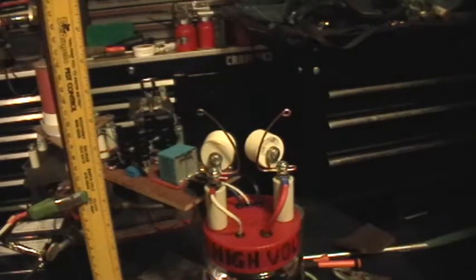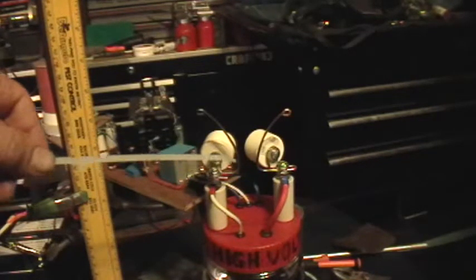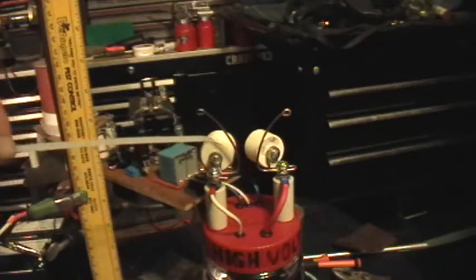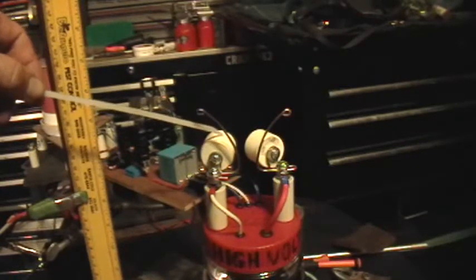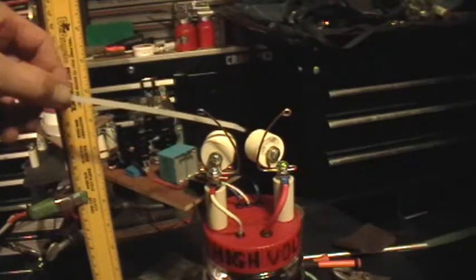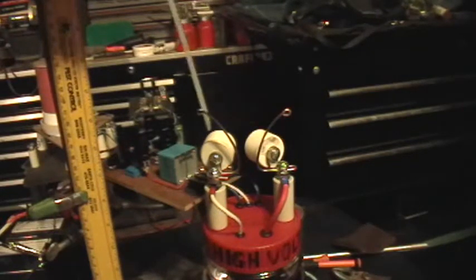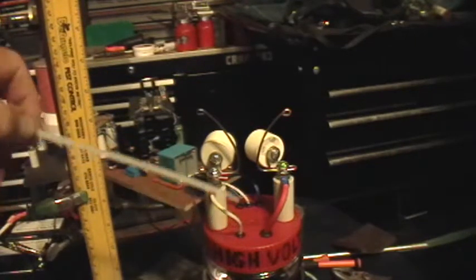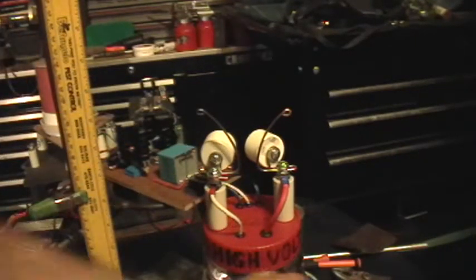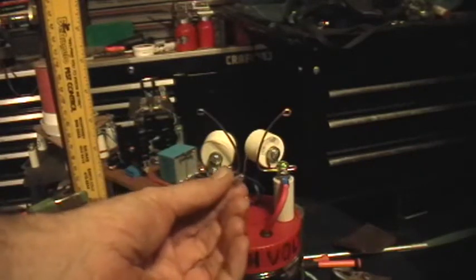What I want to do now is show some of the effects of capacitance on the spark. What I've got here is a Jacob's ladder spark gap, and I've put two doorknob capacitors on there. These are 400 picofarad, 30 kilovolt each capacitors, and they're not connected on the back - they're just facing away. So right now they're not actually in the circuit in any way.